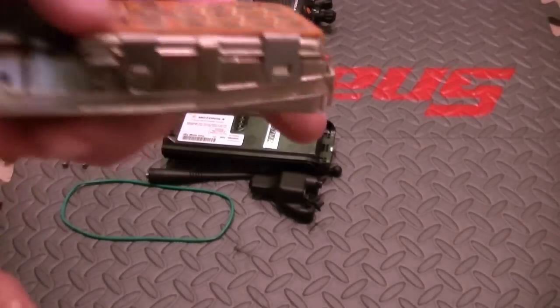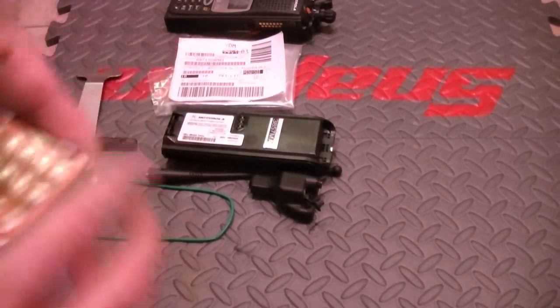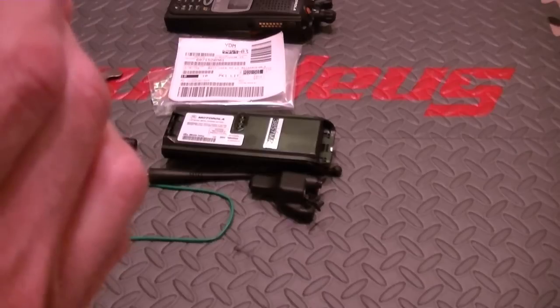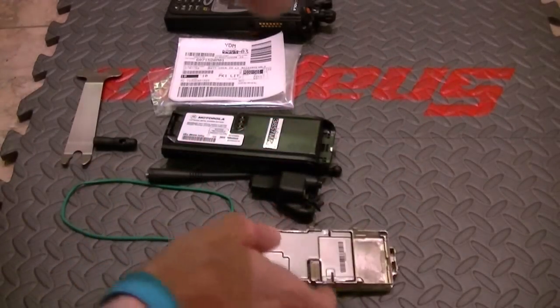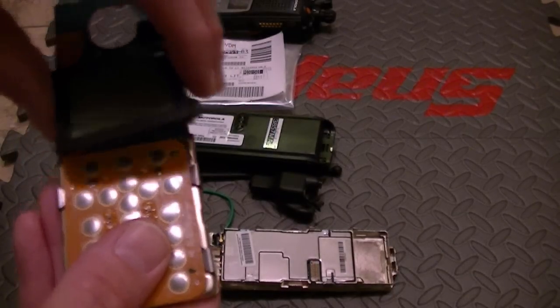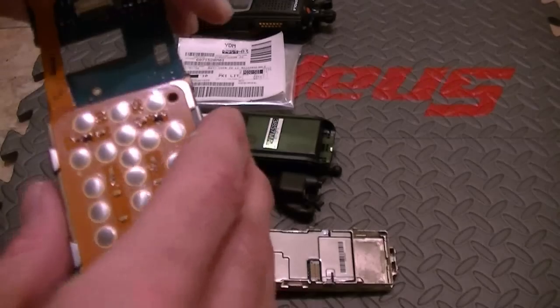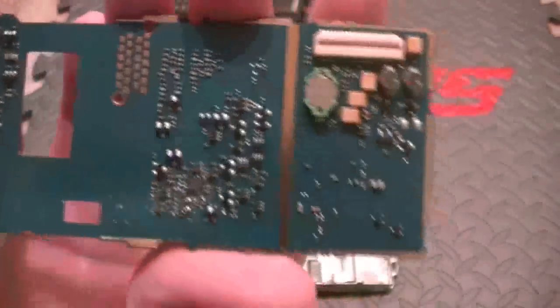That's the bottom, that's the top — still, it's going to be hard to get back on. You can press down a little bit and get a little motion on this. Now this is unseated, and you simply lift the whole assembly up — watch out for that gold piece. Pull this back, set it down. You can now remove your LCD and your keypad. Once you've done that, on the back of this board is where the battery is.